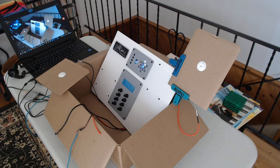And here we are on octave D again. And you can see that it's really a lot quieter. It's not jumping around, it's not doing anything weird. This is me moving my body that's causing the LEDs to move. And if you look at it, you can actually see down in this D octave, you can actually see steps. That's the limited resolution that you have in the far field when doing subsonic things like this. So that's good. I mean, we're actually seeing the numerical steps rather than the noise. The steps are bigger than the noise, which is great.